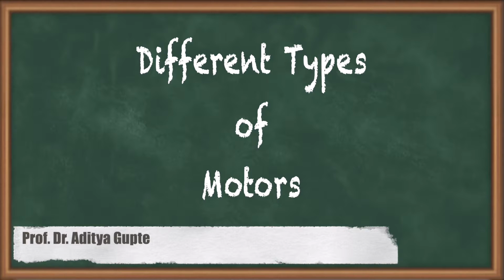The brushless is way more powerful for their weight than brushed motors, and they last way longer. For bigger quads, no question, brushless is king. But for the micro and nano drones, it's fantastic to have these cheap drone motors to crash with confidence.